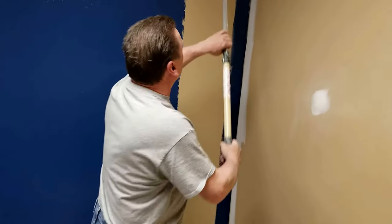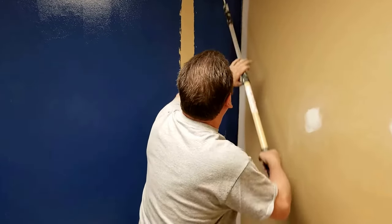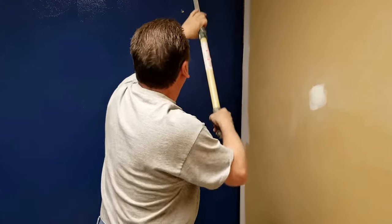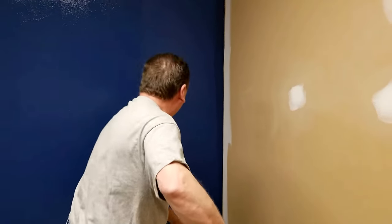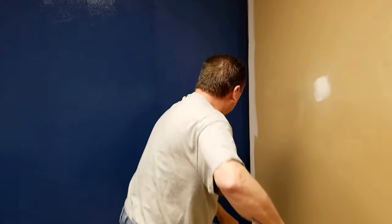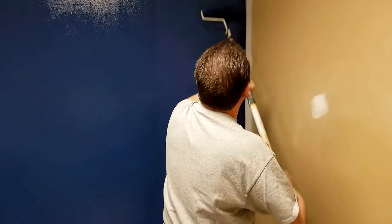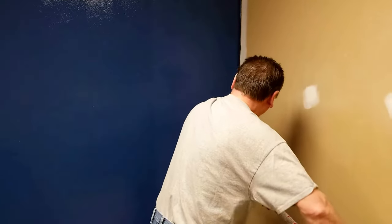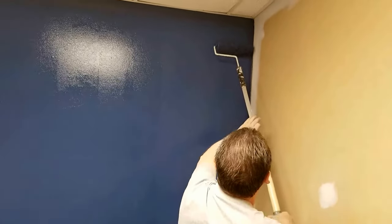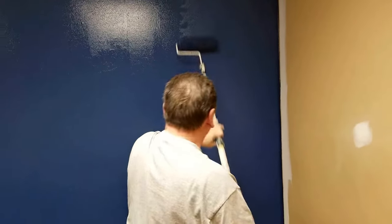When I paint, your best opportunity is to put the paint on the dry part of the wall and then work back into the wall that already has paint on it. And that way, as you're moving along the wall, you come back and it evens out what you're putting on the wall. And it won't leave lap marks.